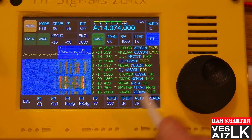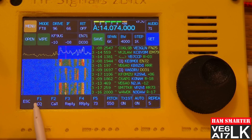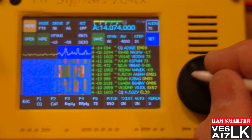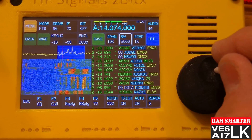There are a bunch of other parameters you can change within the radio. These are all the standard replies, but if you want to get in there and modify your own, they are N1MM compatible macros. That carries across into the world of CW as well when you want to modify your CW macros. The bandwidth on FT8 goes all the way up to 5 kHz audio bandwidth. That means if someone is transmitting at 3500 Hz, that's outside the passband of most receivers, but not this one. This radio will hear people transmitting above the fundamental frequency — in this case 14074 — and you'll be able to receive them. That's a pretty cool feature.